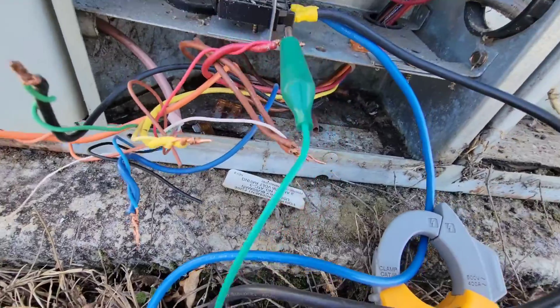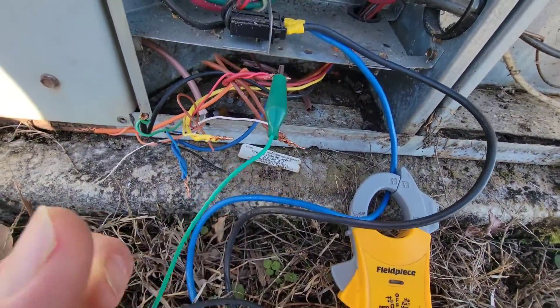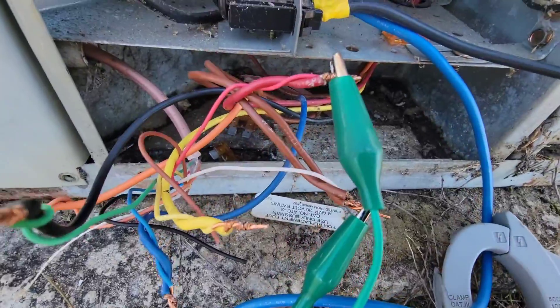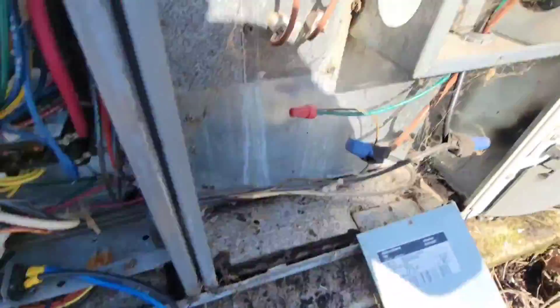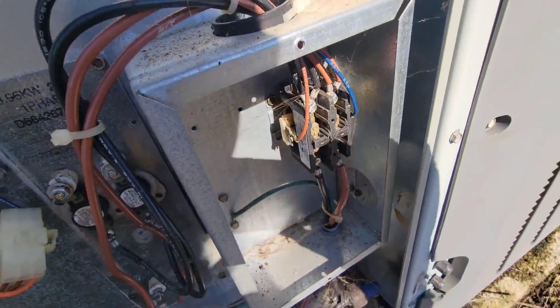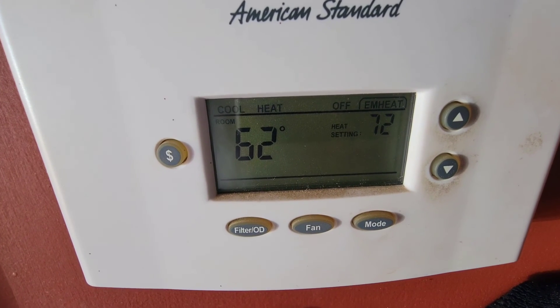Now this right here is W1 and W2 — this is the auxiliary heat strips. That brown wire, white to those two browns — now we're going to energize the heater kit. I don't see any change, contactor isn't pulled in. You can see there's some space in between the contacts and the plunger, so it may take a moment. That power may run through this board here. Let me know what kind of low voltage short problems you've had in the field — post those in the comments. Also don't forget about those videos I put in the description for troubleshooting low voltage shorts.